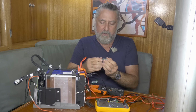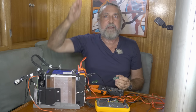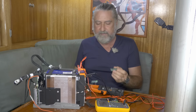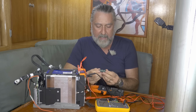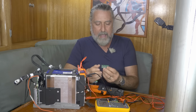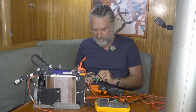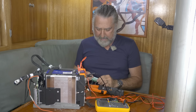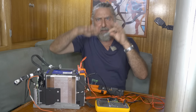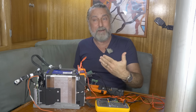If you were concerned though, or you had a great big battery, you know, we have some 400 amp hour batteries in here, and it's going to take more power being moved to be able to balance these out. Two things I could see doing. I haven't tested the first one, but I see no problem with it whatsoever based on the circuit. I don't see why you can't use a stack of these, where you essentially put them all in parallel, give them a little cooling room, and each of them would kind of share the load because they have an internal resistance and that makes things balance out. So if you had several of these, you'd be able to move several amps.